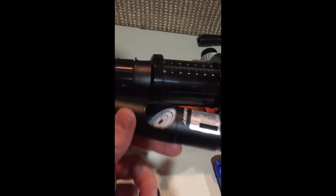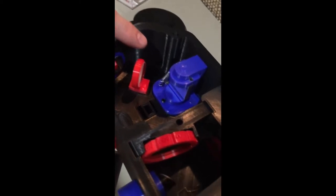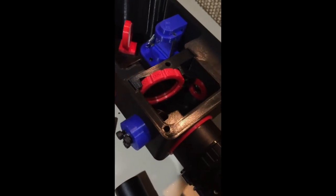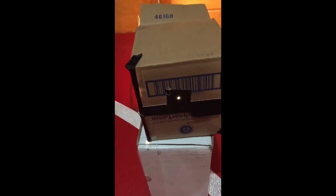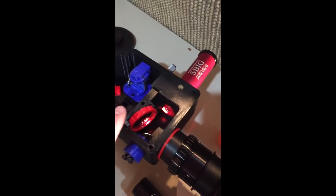I also had a laser collimator. Without the wheel in, I could align my main reflection mirror so it was centered on the collimator and onto the center of the grating — though I don't think you really need to do that. I then just had a light over here, which is a halogen bulb with a little hole in it — that's essentially going to be my calibration light. To start, just go with a big, bright light shining into your scope. I put this in with the pinpoint light focused on the slit, then put in the real slit. The focus changed a tiny bit, but essentially I had that focused. Then I went to a super bright light and that was going into my main mirror.